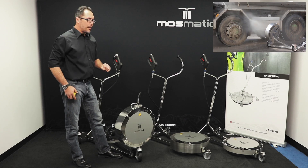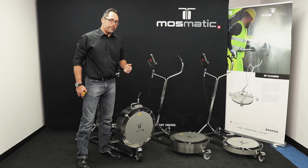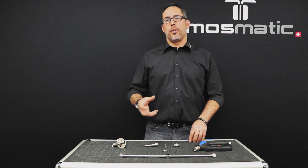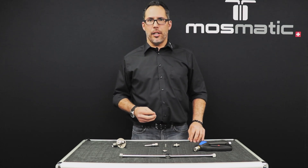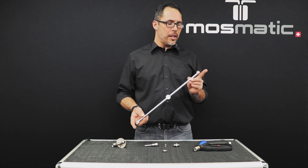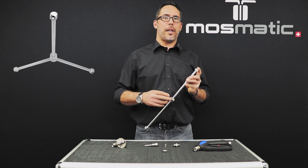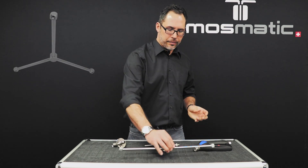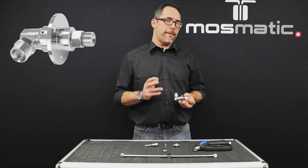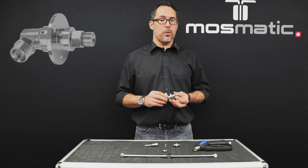All of the units are offered in stainless steel with protection covers to protect against debris, as well as a safety feature to the unit. For replacement items under normal operation, first is the precision machined 304 stainless steel rotor arm — this is the one that comes on our 21-inch unit as a two-nozzle version, versus the 30-inch units which have a three-arm version. All the Hurricanes come with a DYF series swivel rated at 4,000 PSI, 250-degree temp, and you can run chemicals pH 3 to 12 through them.